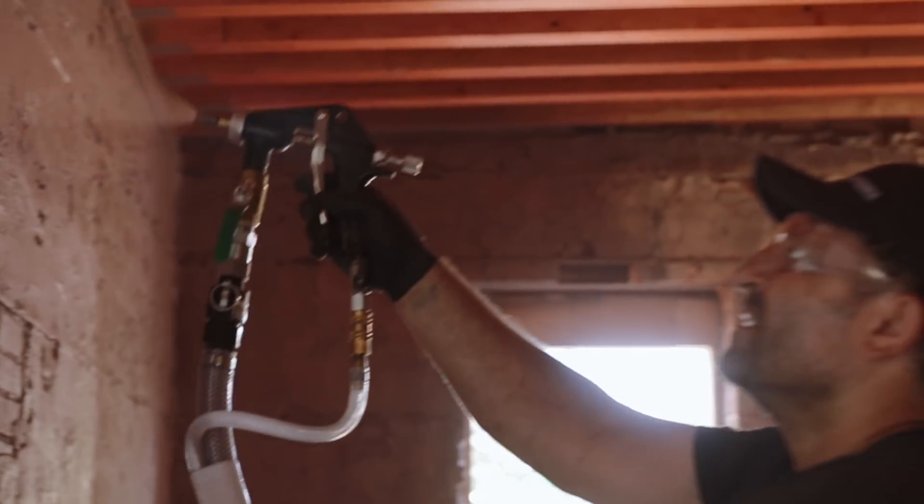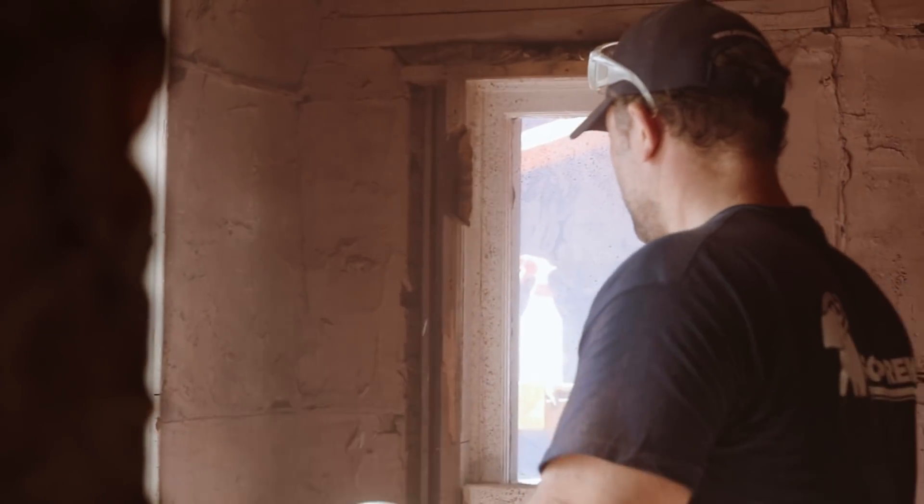Visibly you'll be able to see the membrane, and for a long period of time you'll be able to repair it. We're spraying it horizontally and then coming back and spraying it vertically to make sure we're getting full coverage and proper coverage. Then we'll frame, pulling the frame in about a half inch or an inch away from this wall, and then inject our cellulose. You have the force of air pushing against this side of the building, but also the force of air and vapor from the outside pushing in. You're not going to have breaks in the air barrier, which is extremely important — because if you're trying to seal between all these joist cavities and you tuck-tape it to death, you're never going to seal it perfectly.